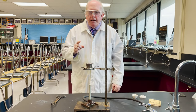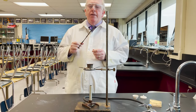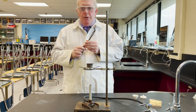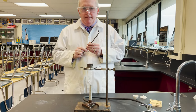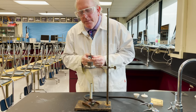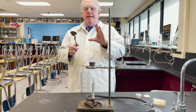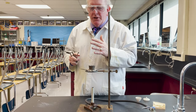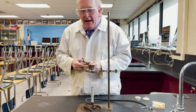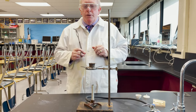It's hot. If it's too hot to touch, don't touch it. Now, these are crucible tongs, and in theory they can be used to handle hot crucibles, but I'm going to encourage you not to use them to handle the crucible — it's too easy to drop them. Occasionally we will use them to take a lid off to look inside. Always do it from a distance back. Never put your head straight over the crucible, because if something were to pop out, you're gonna get a face full.